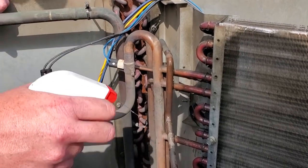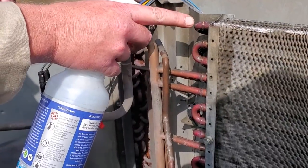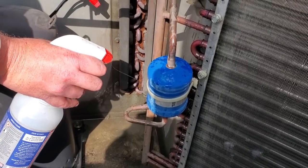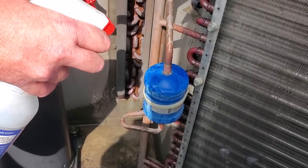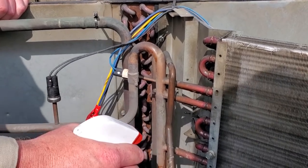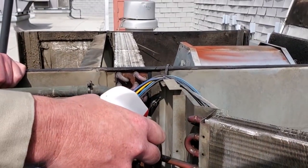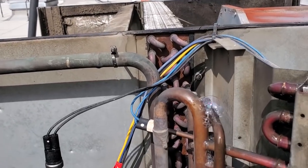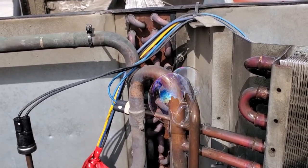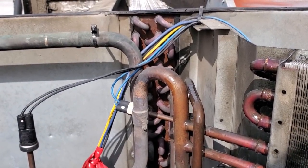You've got plenty on the top — just going down the condenser. But more than likely it's going to be up top because refrigerant's heavier than air so it's going to fall. I'm going to spray the dryer and the liquid line coming out of the dryer. Start at the top and it'll work its way down. Watch how Big Blue works — it's not just a pop, it makes giant bubbles. The way they mix the formula, it makes super thick giant bubbles.